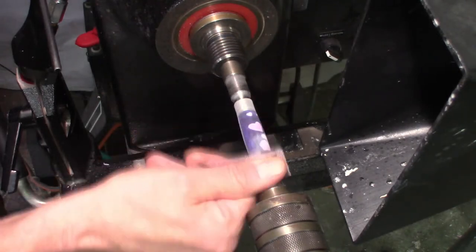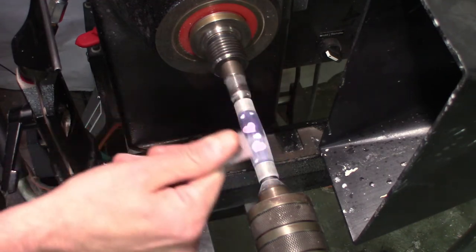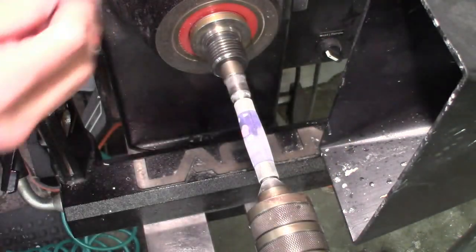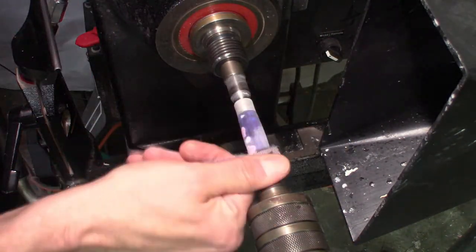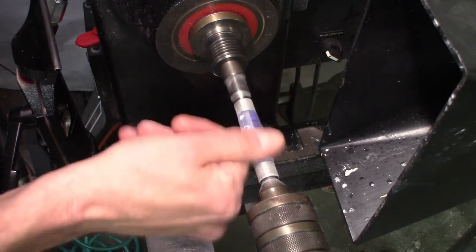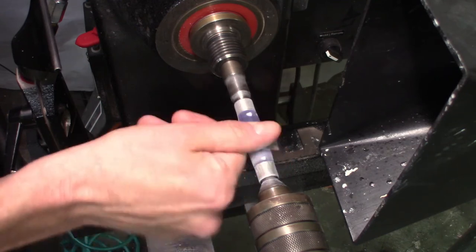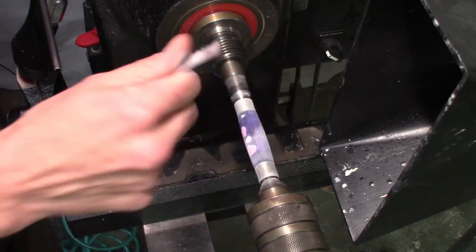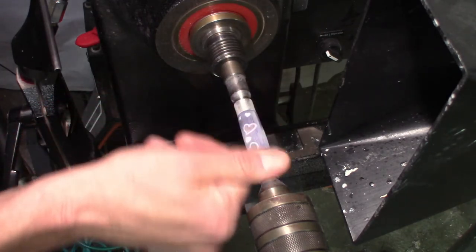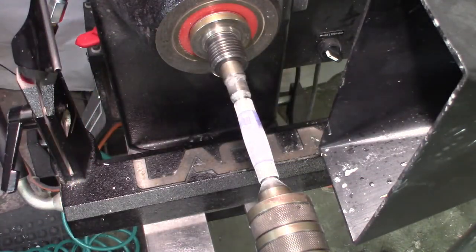So, like, Alumilite Clear Slow is a urethane. It has a 5-day cure schedule, and you can kind of get away with turning things and it being pretty darn hard, close to the final hardness, within a few days, really. Whereas with epoxies, especially on smaller pores like this, you're better off waiting the full 7 days. And Liquid Diamonds is a seven-day cure schedule.